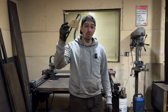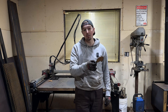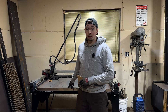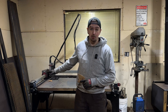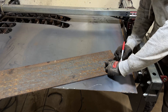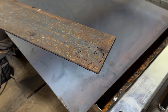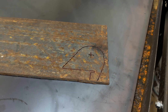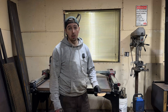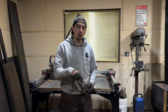Now it's time to turn this cardboard into an actual chunk of metal we can put onto the truss. We're going to have two separate paths here. If you don't have a CNC plasma table and you're just running with a cutoff wheel, you can still do this — just throw the cardboard down onto the piece of metal, trace the outline, and use whatever tool you prefer: a cutoff wheel, a port-a-band saw, or even a band saw to cut it out of your chunk of steel.